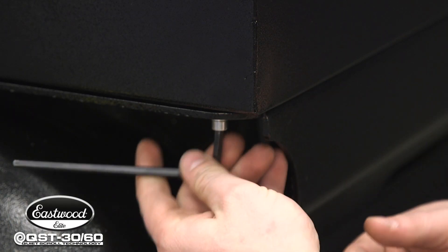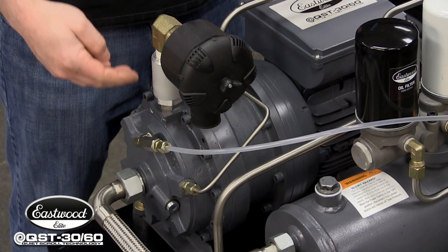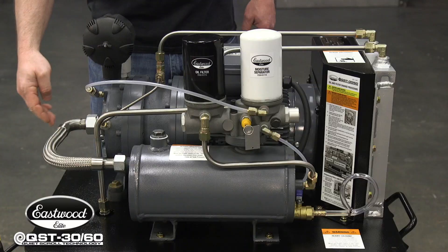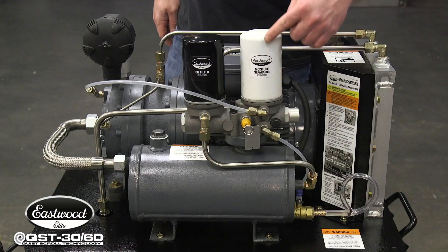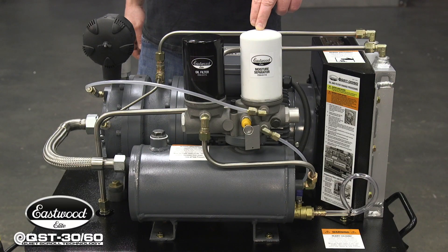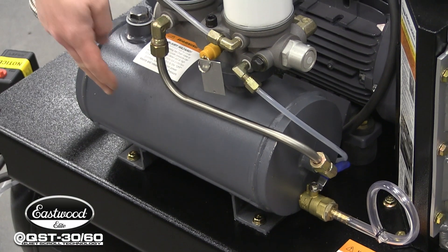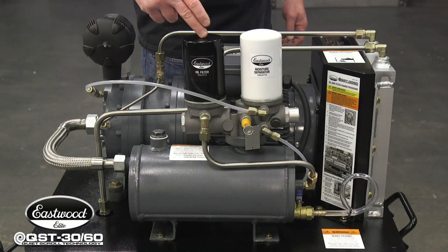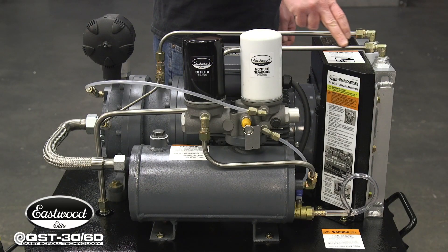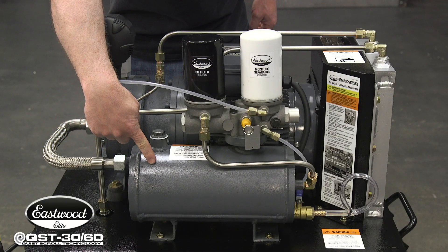Now let's get the hood off and take a look inside so you can really see how it works. Air enters through the intake, is compressed through the scroll compressor, and then exhausted through this line where it goes into the oil separator tank. The air then comes up through the manifold into the moisture filter, which removes about 90% of the moisture out of the air, and then goes down into the tank to be pressurized. The second part of the system is the oil side — this pressurized oil tank contains scroll oil, which moves through the filter to remove any contaminants. The oil then passes through the cooler, goes through this line into the scroll, and then returns to the reservoir, and the process repeats.